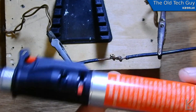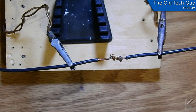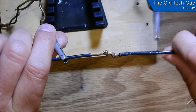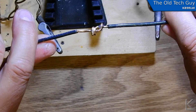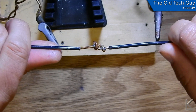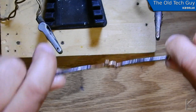They're around 30 to 40 dollars. This is a Blazer. They come with a whole range of tips that you can use for different applications. I use this thing to death. But that's the basic idea behind the lineman's splice, and you end up with a very, very strong joint. Back when I was at the house, I had an antenna that was a 40 meter dipole, and I extended it to 80 using the lineman's splice on the ends. It was up for six years through all kinds of wind and storms, and I never had any problem with the joint failing. That's the strongest way to put the wires together.